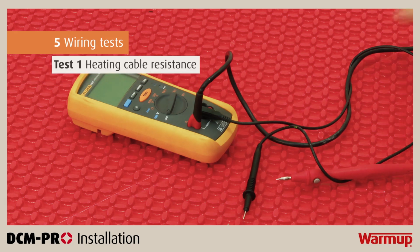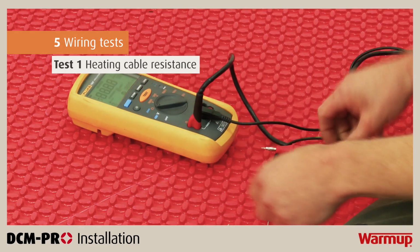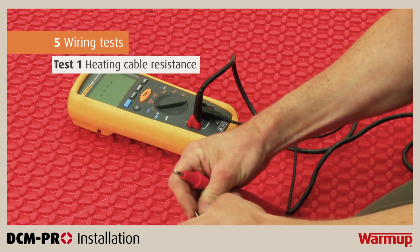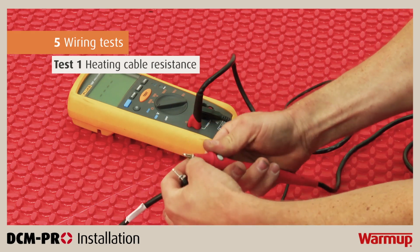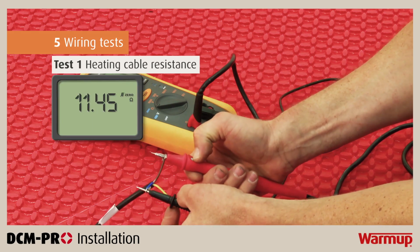This first test is to verify the heating cable resistance. Connect a multimeter to the heater across live and neutral in order to determine the resistance. Make sure that the results of the tests show measurements that are within plus or minus 5% of the resistance values provided in the installation manual. Then record your results in the control card.